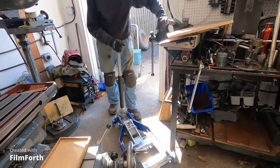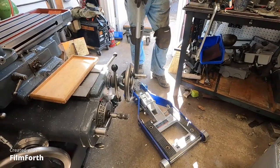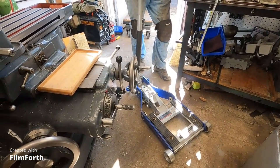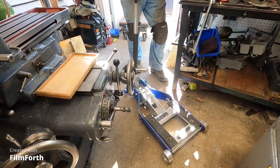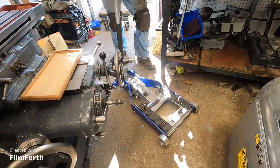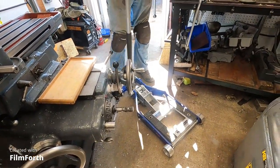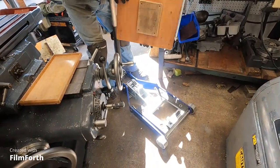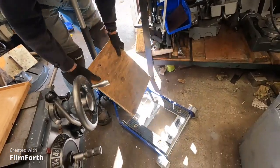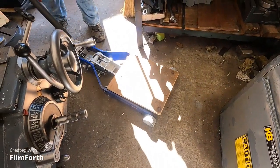This is an ATV motorcycle lift — and it's probably one of the most terrible ATV motorcycle lifts ever made. Because if you try to lift your 800-pound Harley Davidson with this, you're going to probably dump it on yourself. I don't know what kind of motorcycle you can lift with this, but I repurposed it as a rotary table and vise lift. I made this adapter board here out of technical plywood, and it fits right in that little square, and I can jack it up.